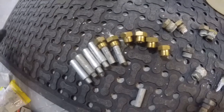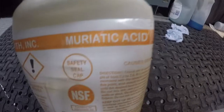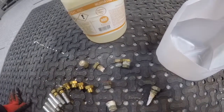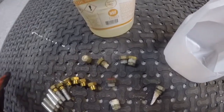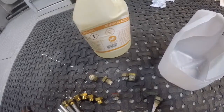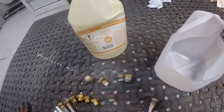So I have a method to save you guys some money, and that would be muriatic acid. I've been doing this for a solid year and a half and have had no negative repercussions. You want to take a milk jug or a coffee can — plastic, not metal, because this is highly corrosive — and pour muriatic acid in there and submerge your old zinc plugs. You are going to want PPE: gloves, eye protection, and a breathing apparatus. The harms of inhaling zinc fumes are quite dangerous — metal fume fever, for instance. That's why you don't weld galvanized metal. If you go outside in a well-ventilated area and do this, I think you guys will have good luck.